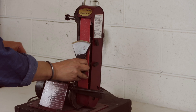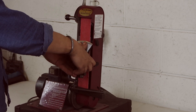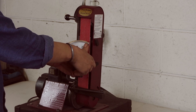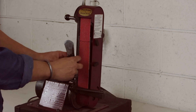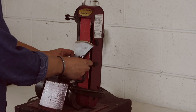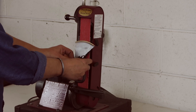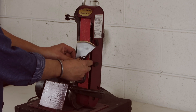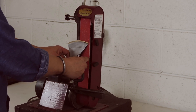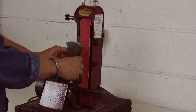Now we're on to grinding. What I tend to do is put my fingers in the eye of the axe and use my thumbs to guide. I'm not pressing down hard — this is a fresh belt, it'll cut really cleanly and doesn't need a lot of pressure — but I do need to guide and put a bit more pressure on here to make the corners engage. Don't want to put your fingers behind because they're going to get caught. Then turn it over and do the other side. I always start in the middle and then work to a corner, and I don't want to bring the corner much past the edge — then back to the centre, another corner, don't go much past the edge. If you start in the centre it will naturally sit flat; if you start in the corner there's a chance of it digging in and cutting through the belt.